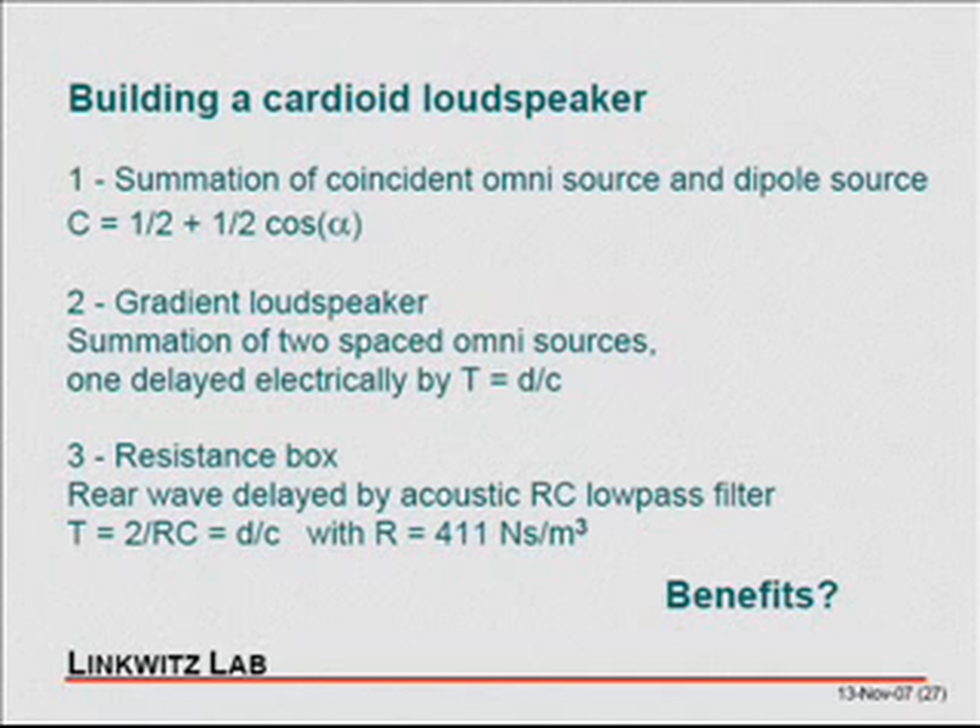When I looked into this, I found the solution in a totally different field — the field of chemical filters. Chemists have to filtrate fluids, and they build filters that work in these resistance ranges. The best I found is a felt — a metal felt — which is basically metal woven together so it looks like a felt, maybe this thick.